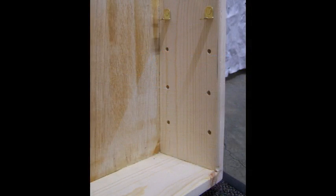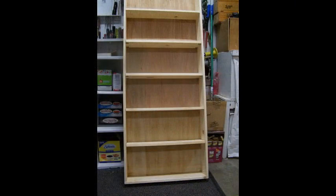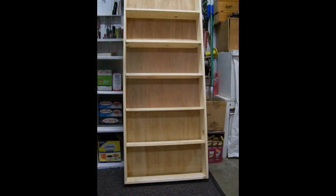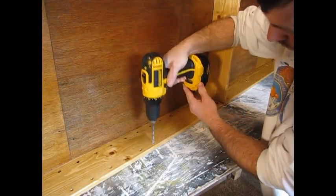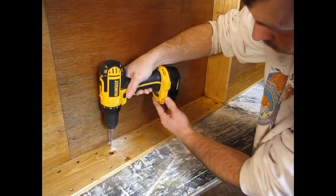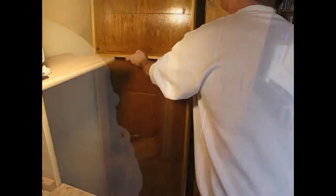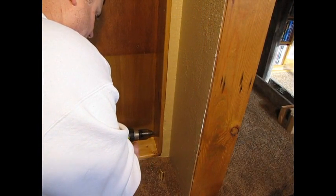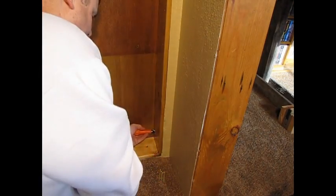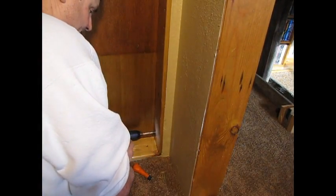Install your pins, then measure and cut your shelves to fit between the pins. It's starting to look like a bookshelf! Stain your project, then cover it with a couple of coats of polyurethane. After the polyurethane has dried, clean the holes out again because some of that polyurethane has gotten down in the holes and now your pins won't fit. You're ready for your final time to put it back in the wall. Drill holes in all four corners, countersink the holes, then install screws — paying very close attention not to torque the screws so tight as to deform the framework of your shelves.